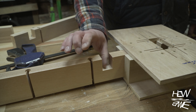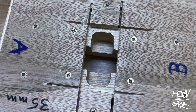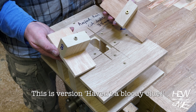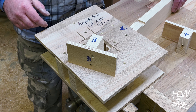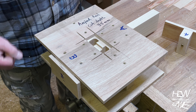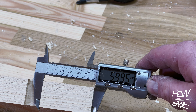The biggest problem with making stuff is measuring stuff — best avoid it as much as possible because that is introducing human error. If you use relative measurements that's even better, or like I'm doing here, that's always going to be exactly the same when I shove that piece of wood in. Those screws are my adjustments, so every time I put a piece of wood it's going to be exactly the same. And that's pretty close — that's good enough for me.